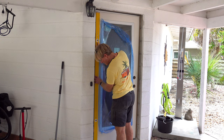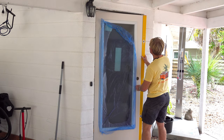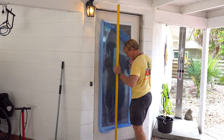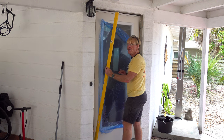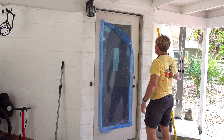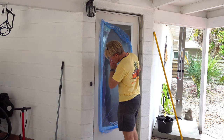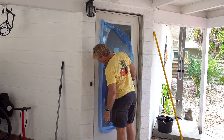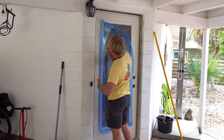Now my hinges are just absolutely plumb. It's better to check out here because this really emphasizes any that it's off. That's absolutely plumb as well. What I'm not sure about is this way — flushing to the inside as long as it works. Now that's plumb too. I wasn't going to worry too much about that as long as the door were tipped a little bit out or in — as long as it's flush around the inside and it's working. Now I'm going to go ahead and lock up the side that the hinges are on because that's where the weight is. I'm going to put some shims in and a couple more finish nails, then do my tap cons to get this side just kind of locked in.